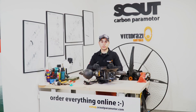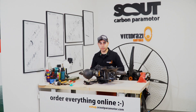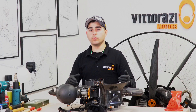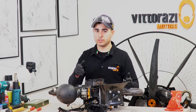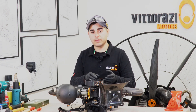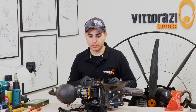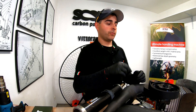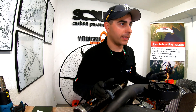In order to change the crankshaft seals, first we will need to remove any accessories that are bolted onto the crankshaft. On the belt side, that means the clutch bell and the clutch. On the other side, we will need to remove the flywheel. We already have videos about how to remove, inspect, and replace the clutch, flywheel, and everything. If you are unsure how to get to the bare crankshaft, please check the links in the description below — you will find a video for every operation. Fast forward until we have the crankshaft without any accessories.